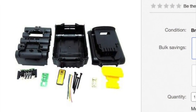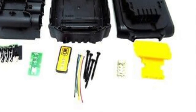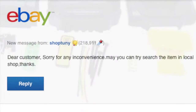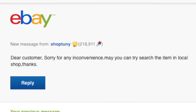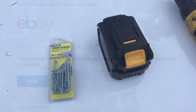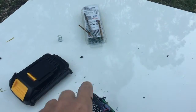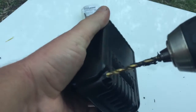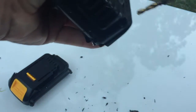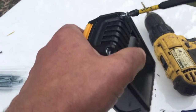Both of these battery shells have the same damning problem: no screws. They are about 2.5mm by 38mm long and you won't find them anywhere. I contacted the eBay seller and they replied, 'Maybe you can find them in a local shop.' Well thanks — you might as well tell me to move somewhere with a proper supply chain. So I went to Bunnings and got 6G 40mm MDF screws, then drilled out the holes to 4mm. The countersunk head was not a problem and the screws secured everything nicely.